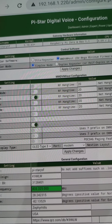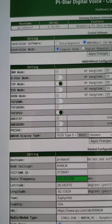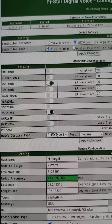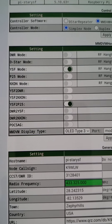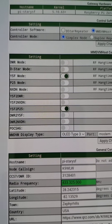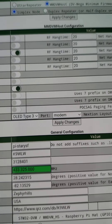I'm going to show you the configuration. In the MMDVM host configuration, you of course have your YSF mode turned on. And then in the cross mode list below, you'll see YSF to P25. Turn that switch on and then hit apply changes and wait for it to update.